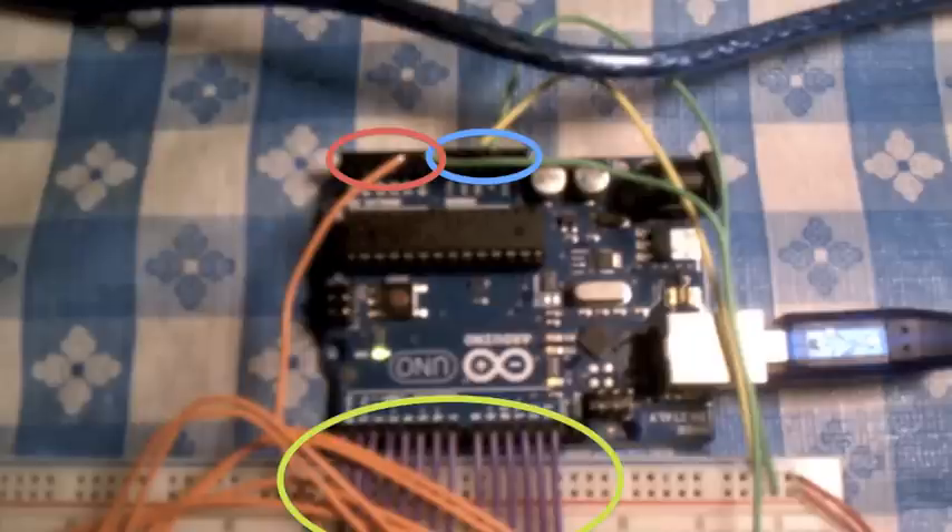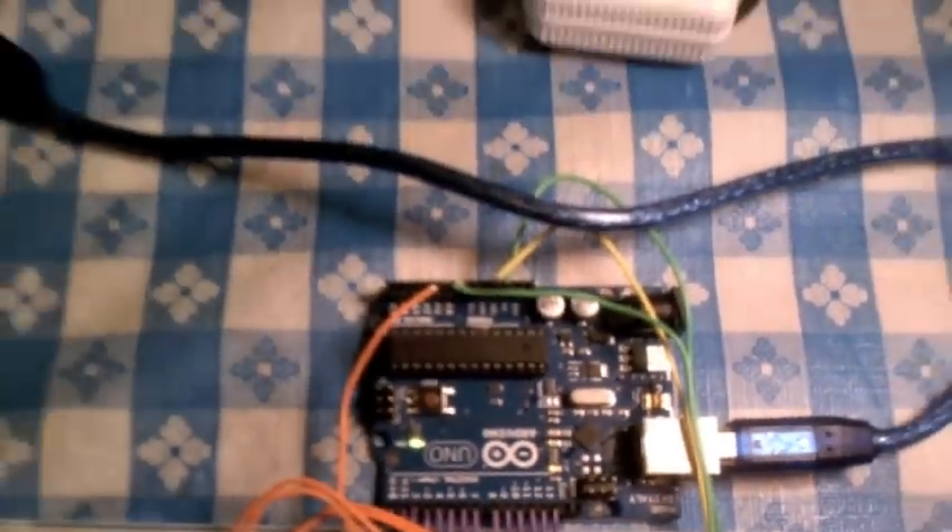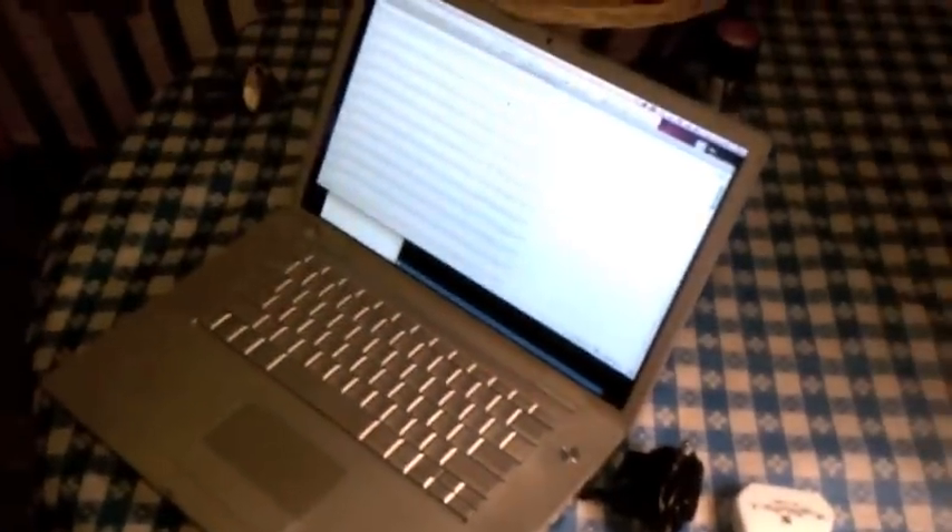For this project I've used USB power, but it can also be plugged into the wall using a 9-volt adapter. The final component is my laptop. The Arduino is programmed using a semi-C programming language and there's an IDE for both Windows and Mac, programmed right over an ordinary USB cable, so it's quite convenient.